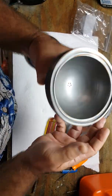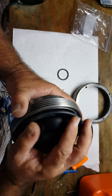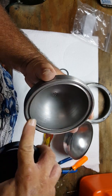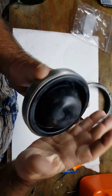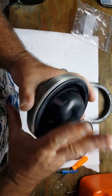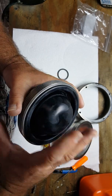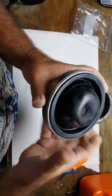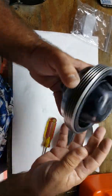We're going to put the diaphragm. This is the diaphragm. Diaphragm fits in here. You can see how we cleaned this all the way around. That was glass beaded and it was polished so that this will slide right down into there. That's your diaphragm. That's what separates the 1200 psi of nitrogen from the RR363 brake fluid. We're going to seat that down there just like that, nice and smooth. You can see that right there.